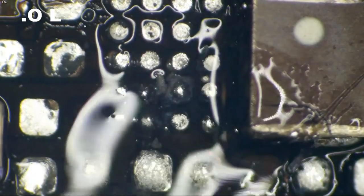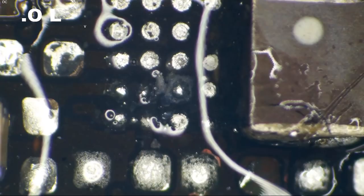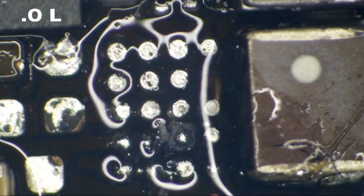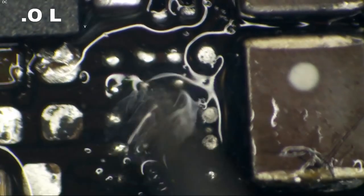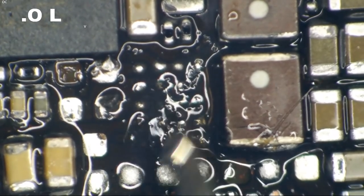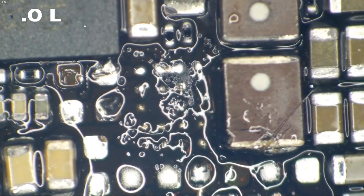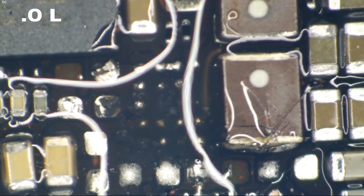I'm excited. I think we're going to get the data off of this one. I like when I start running into things that I'm familiar with. There are a lot of times doing these repairs where you're starting out and you've already had a half a dozen of them that start like this that don't end well. This is not one of those. I'm starting to run into things that make me feel confident that we're going to get the data, because we've got carnage under the display power management IC. We have a technician that has been screwing with all things display power. And I removed the Chestnut IC, our display power supply, and I start running into things that he missed, which means we are very likely going to get this to a point where we can get the data today.